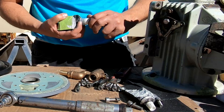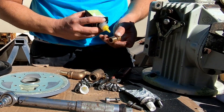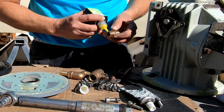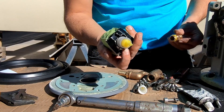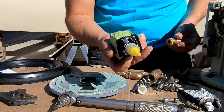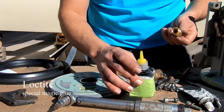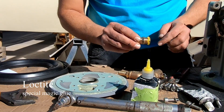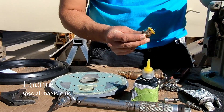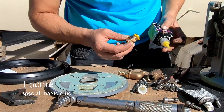The plastic fitting did not make me feel very good in the middle of the ocean - if you have to break it, you're up the creek. Anyway, we have the new gear. This stuff is basically a Loctite specially designed for gas and hose fittings. It's going to do two things: it's going to seal the thread and it's going to hold it in position so it can't rotate. Quite important on this little bad boy.